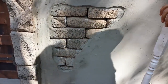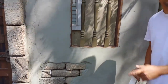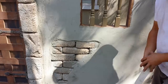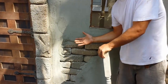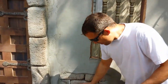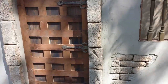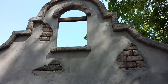Every one of these places where you see the brick, we did a little brick pocket — a lot like what we did in the jail. What I did is cut out the luan or the underlining, then took another piece and capped it on the back side of the one-by-three, thus creating a little space. Then I slid all these bricks in, got them into place, cut them, and they still need to be painted and hard-coated in some places. We're also going to stick a bell up there.